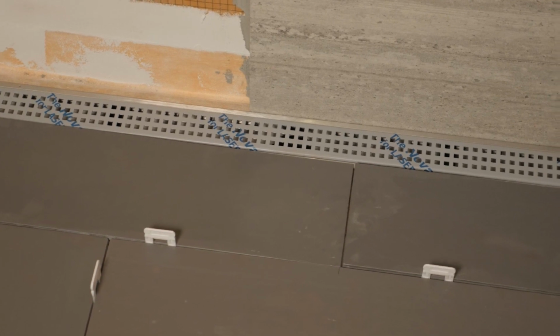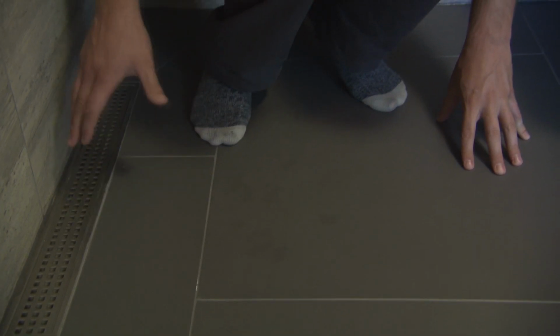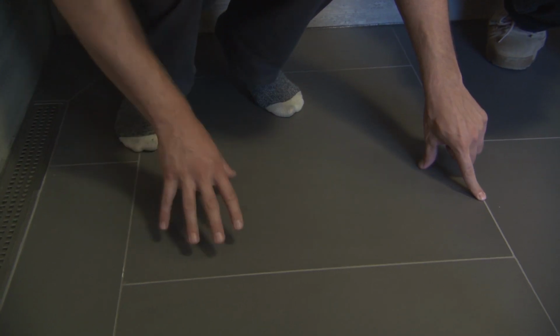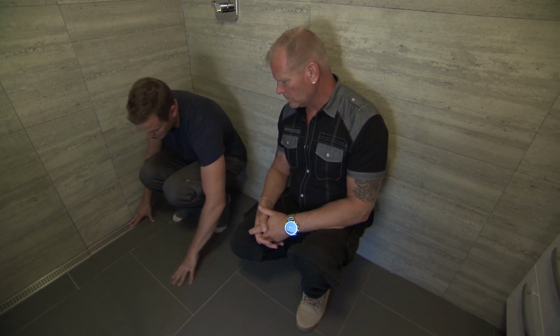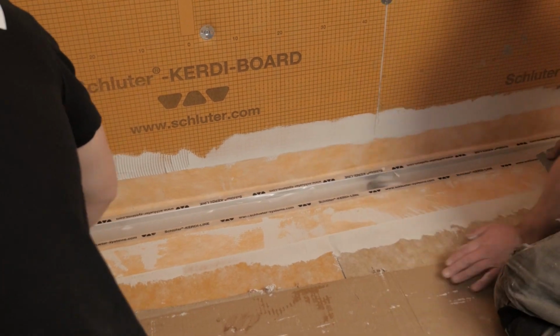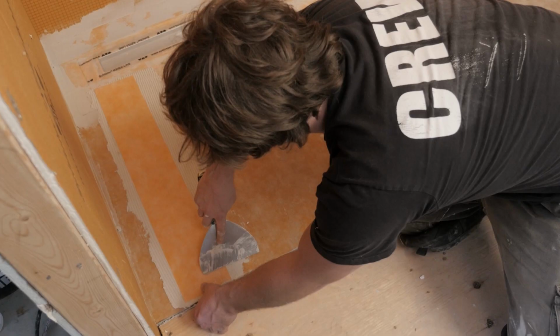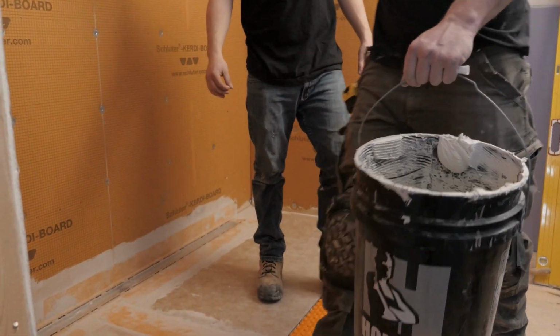What I love about this is with the tile, we planned this out perfectly because we always think ahead, so we've given ourselves a nice space here so we could slope it, and then our slope comes exactly from the edge of this tile all the way down. As you can see, our glass is here, so all the water sheds from here into our line drain. The Schluter system that's in here is 100% watertight. We put tile baseboards on the sides. We've waterproofed this entire bathroom with Schluter products, so we're completely good in here. I'm not worried about that, and our drainage is perfect.